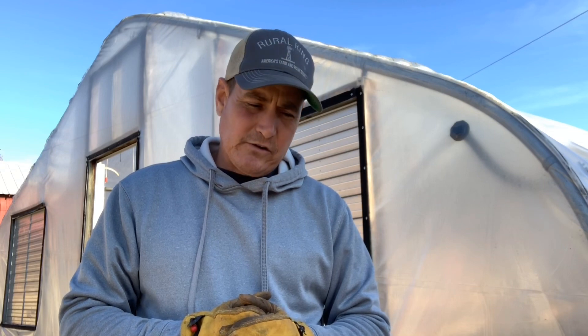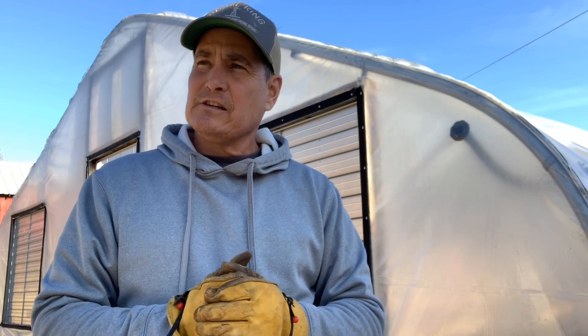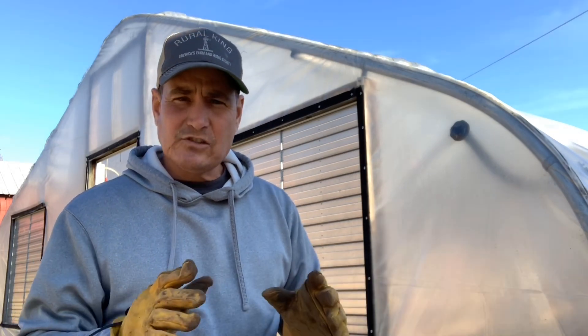We've learned a lot over the last 20 years, and I want to make it a little easier — how to avoid certain problems that we know are going to come up, and maybe this will help you just a little bit. This greenhouse was built in 2001 and this will be its fourth covering. Every six years we recover a greenhouse that's covered with polyethylene, and it's really considered a four-year plastic, but I can get six out of it without any problems. When it gets a little bit older, it kind of changes the way that the light goes through it, and I can actually see a little bit of a difference in plant growth and how they perform. So we stick with six years, and so far that's worked really well for us.